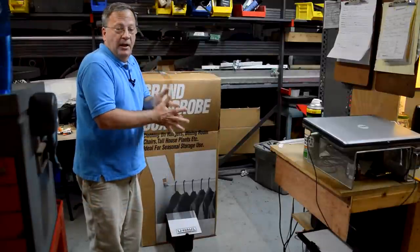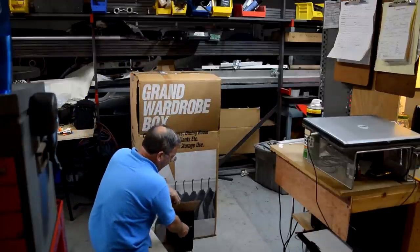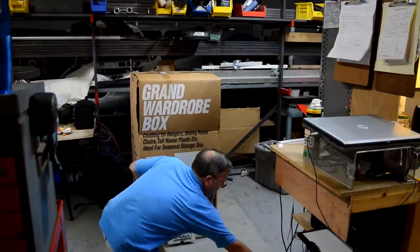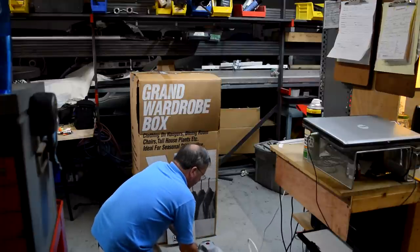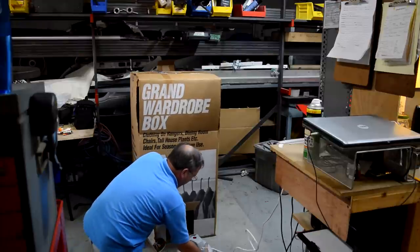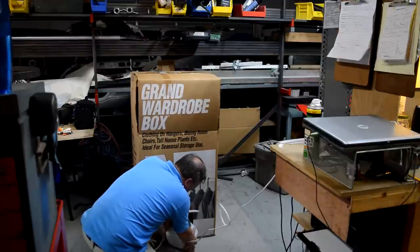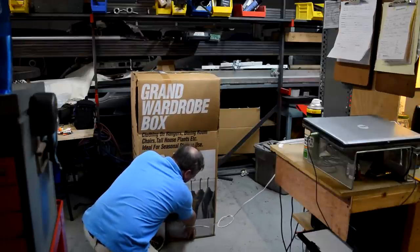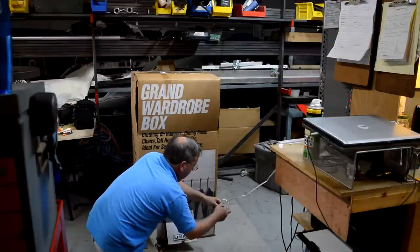We've been in the hot box now for about 10 minutes. So what I'm going to do now is remove our dry heat source, and cut that off. And down here I've got our little moisture pot, moisture provider, which is our little vaporizer. And we're going to control the conditions under which this metal is rusting. So by getting it hot, we've heated up the metal so that none of the water condenses on it. It makes these pretty little polka dots all over everything.